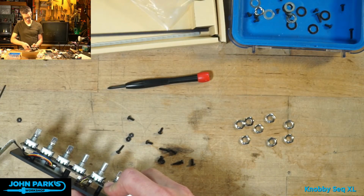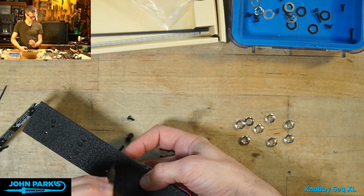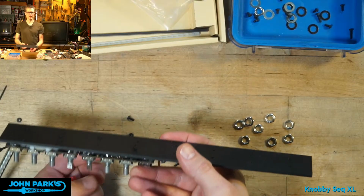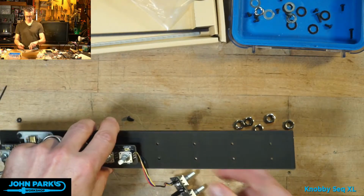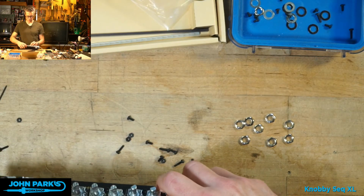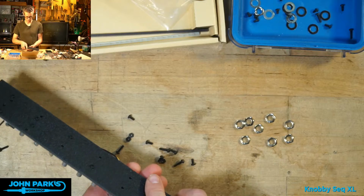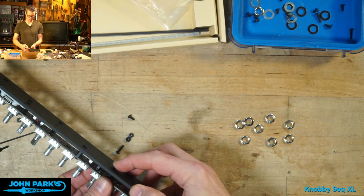And I talked about this last week, but essentially I was able to bring in the CAD files that the Ruiz brothers made for these quad rotary encoder boards and get nice precise measurements off of them. Drew a little rectangle and created a little workflow in Rhino using Grasshopper to parametrically build this. I didn't design it to be parametric in the sense of giving a user a slider for width or anything like that, but it was very simple to just double the width of the thing and double the instances of the holes. So it didn't take much work to move this from 8 to 16 encoders.